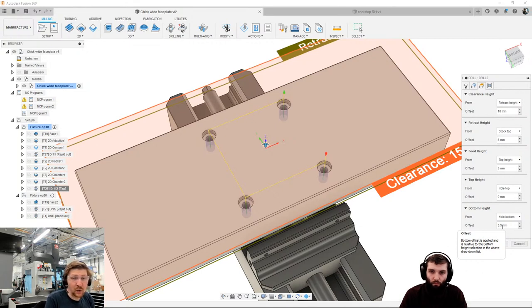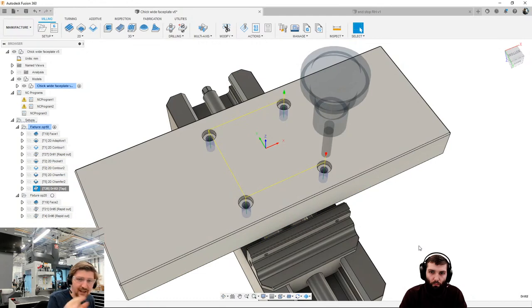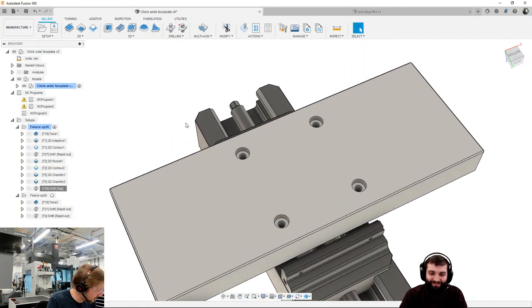But you then have to consider as well the amount of lead-in teeth that you're going to effectively be missing on your tap. So effectively what you've got is the first one, two, three, whatever size lead-in you've got, the teeth or the pitch of the tap as well, those will not be fully formed threads. So a screw will not be able to go into them. So you've got to consider the fact that you don't want to bottom the tap out in the hole, because you'll probably snap your tap doing that. And then you've also got to look at, though, that you won't actually have a full thread at those bottom few teeth. It will be slightly higher. So, and also, again, remember the chamfering top tip? That as well goes into that little category of my tapping top tips.